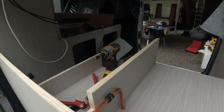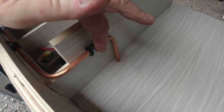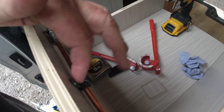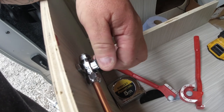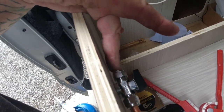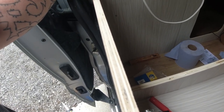It's gone through the top panel and that's been sycaflexed all the way around - same here, sycaflexed there, just to seal this gas box up all the way around. As you can see, the gas pipe comes up through here, it bends around this corner, there's a P clip there, and there's your gas valve to turn on and off from inside the van. There's going to be a pipe which comes out of there, runs along and then goes up into the hob.